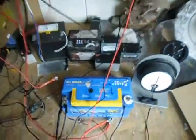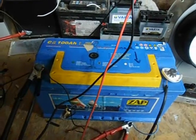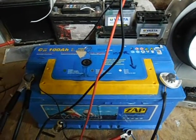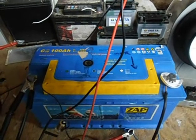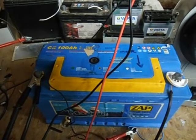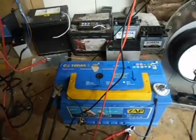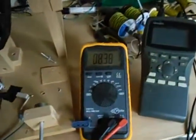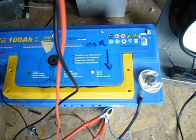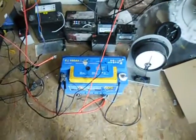I'm trying to get this battery back online. I bought it for 5 euros yesterday — it's a big 100 amp-hour marine battery. It was at 8 volts when I connected it to the cap pulser, and after an hour it went up to over 12 volts. But later it dropped back down to around 8 volts. There's also a dent on it, and when I tried a normal battery charger it got hot at that spot, so it's probably shorted internally.